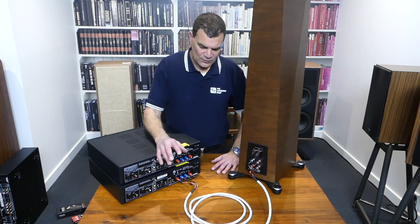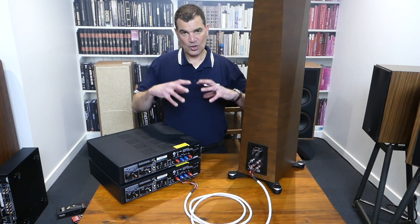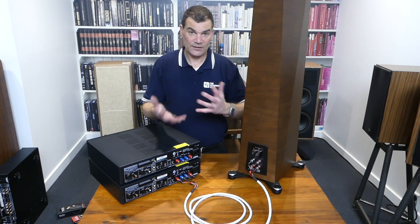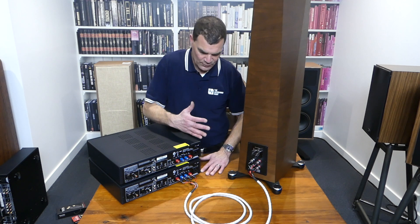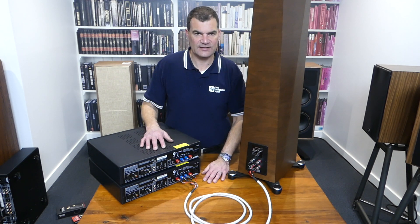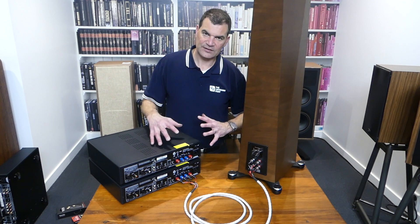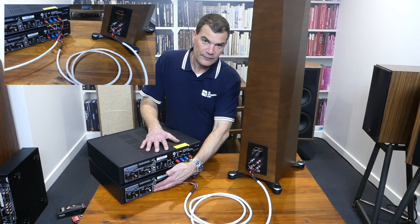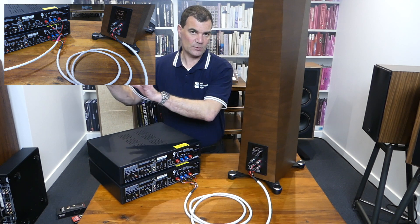The advantages are quite clear: a lowering of total harmonic distortion and an increasing amount of current and control. In this configuration, 160 watts instead of 80 watts. And this 4-to-4 configuration is also nice and easy from a speaker wiring perspective and perhaps a little less fussy — you can clearly see that one amplifier will be associated with one speaker and the other amplifier with the other.